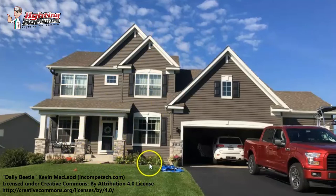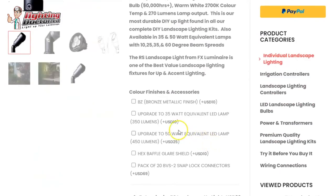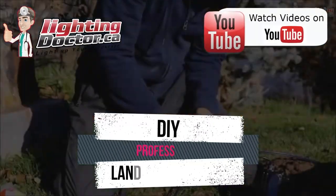So I talked about lighting these pillars, but I would also try and have one of those up lights here underneath the window, again shining fairly upright, because I want to throw light up here. The only difference is I would probably upgrade the lamp a little bit from a standard 4 watt LED, which is what comes in it, to a 5 watt, which we call a 35 watt equivalent. The reason being is because I want to be able to shoot that light up to the second story.